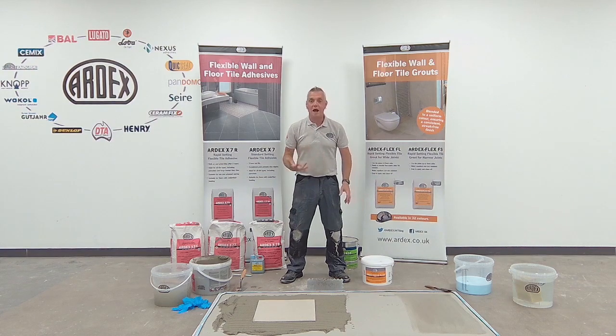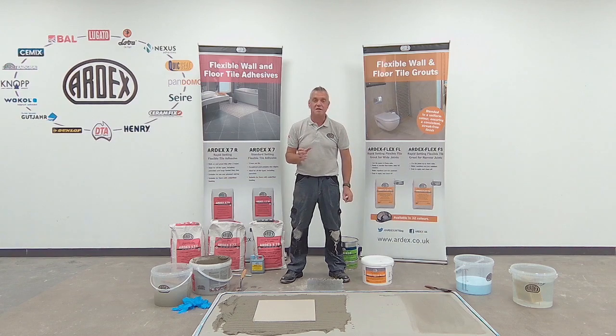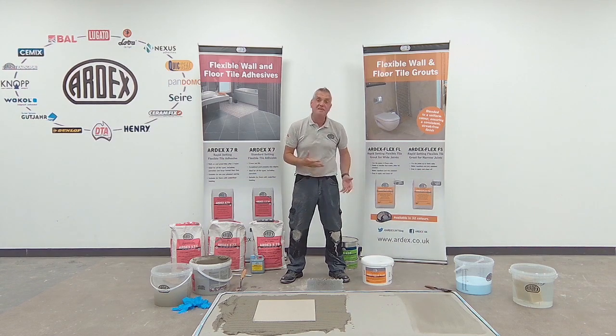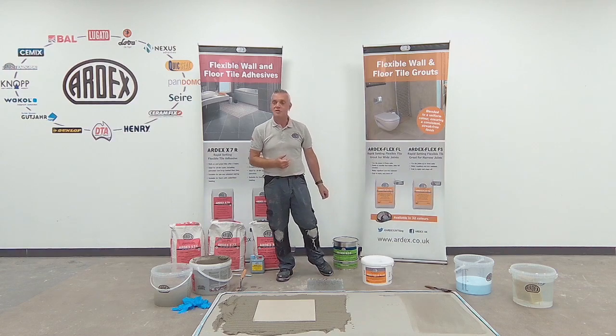With regards to epoxies, where you can, try to work in teams. The good thing about EG18 Plus is it's got 60 minutes at its optimum temperature of 20 degrees. That will reduce as you move to 25 and beyond, so you might be looking at 30 minutes. Make sure whatever you mix up will be used in that time. You may even have to split the unit down by half. If you're grouting a lot of big tiles but only using a minimum amount of epoxy at one time, it might be a good idea to split the pack so that you don't waste any of the product. That also applies, as I said before, to epoxy primers and so on.